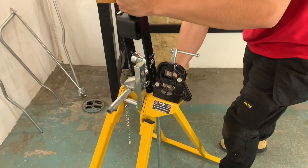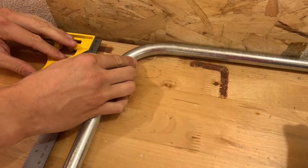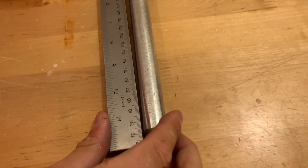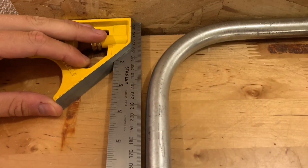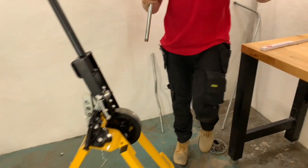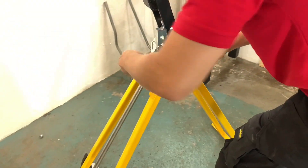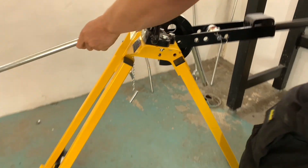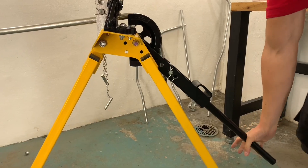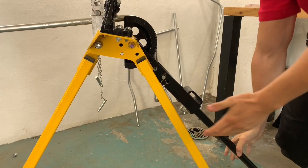I'm going to see what that looks like. So I've bent this piece of conduit now. I'm going to bring my set square in just to check it is 90 degrees. Slightly underbent — it's touching at the bottom end and there is a gap running up, so I need just a touch more. It's always better to be slightly underbent than overbent. Making sure you put it back in exactly the same way as it was before, and I'll use not much more than the weight of my arm — we only need a touch.